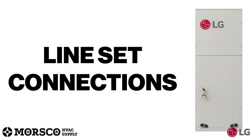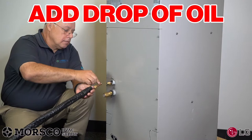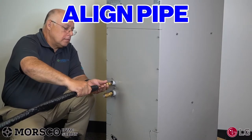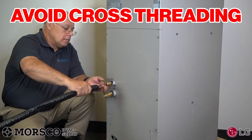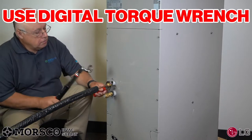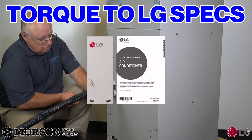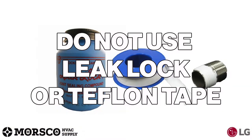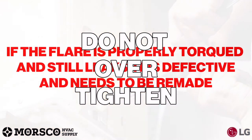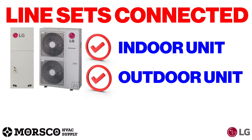Check for proper flare matchup. Use a small amount of synthetic oil on the back of the flare and the male threads — do not use too much, a drop will do. Align the pipe before tightening and be sure the flare nut does not cross threads when tightened. Always use a backup wrench on all flare connections and use a digital torque wrench with a digital display. Always torque to LG recommended torque specs found in the LG installation guide. Do not use leak lock or Teflon tape on flares, and do not over-tighten flares trying to stop leaking — if the flare is properly torqued and still leaks, it is defective and needs to be remade.